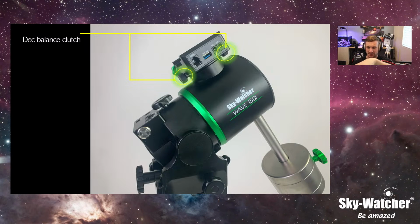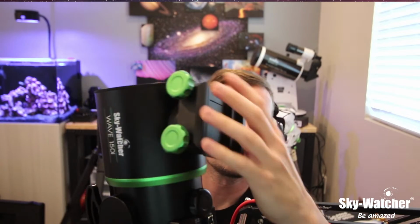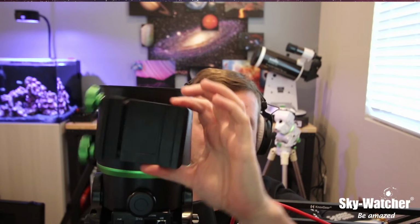So let me just loosen the deck ones here and we'll show you. They need to be backed out a bit. Probably about 20 degrees, I would say. So on the deck assembly, let me go to full screen here so you guys can actually see it again. Here we go. So here's the deck. I have taken the stops out. Here's the screws. They thread into little holes underneath. But you can see you have about, I would say, 20 degrees or so of movement.